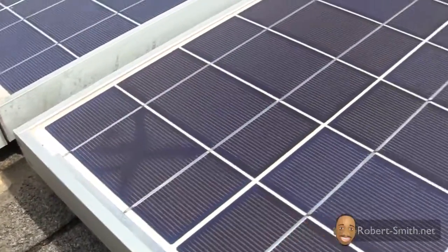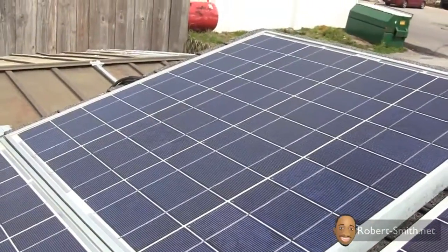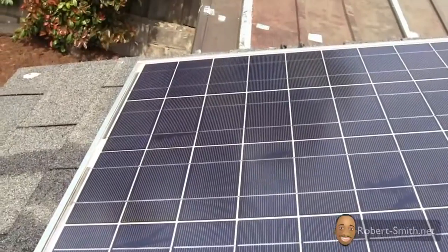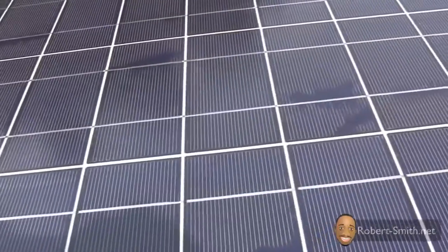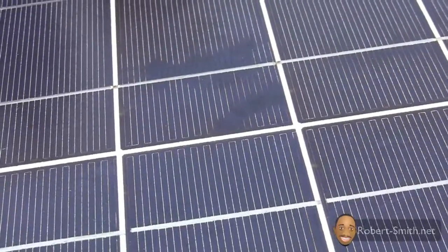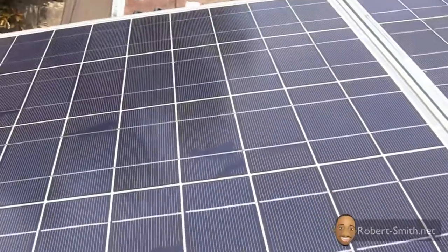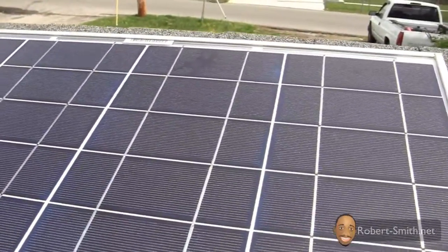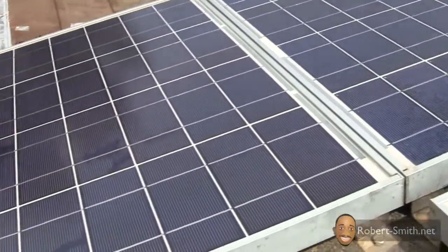But I still wanted to see what causes this discoloration. After doing some quick research, I found that some say it's a problem with materials or workmanship when the solar panels are being produced, or it is caused by moisture from condensation on the metal contacts spreading out away from the surrounding cell surfaces — and the list of possibilities just went on and on. The root cause hasn't really been found, but one can probably conclude it has something to do with workmanship during production where all the air was maybe not fully vacuumed out, and after being exposed to sun and heat this problem starts to occur over time. In many cases the solar panels do produce the amount of power they're supposed to, so whatever is causing this does not appear to be affecting power output — yet.